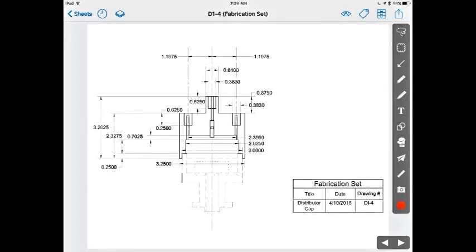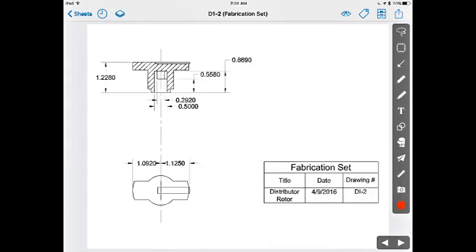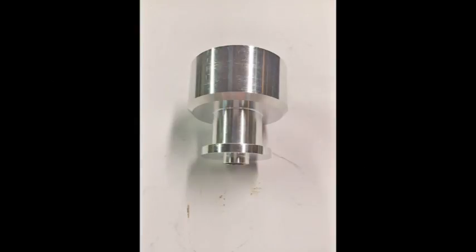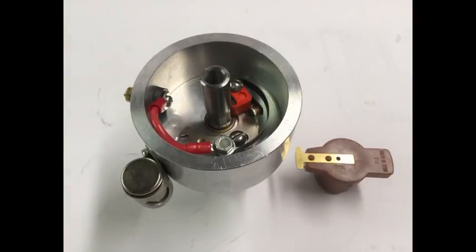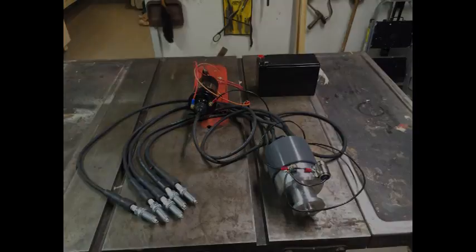For ignition, I needed a 5-cylinder distributor. I used components I was familiar with: points and condenser from a 1965 Triumph Spitfire, distributor rotor from a 1964 Toyota Corona, the ignition coil and ignition wires are for a 1968 Buick LeSabre.